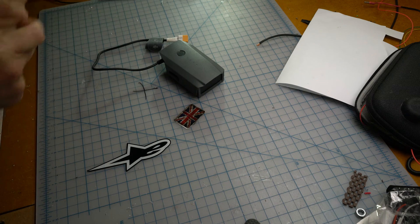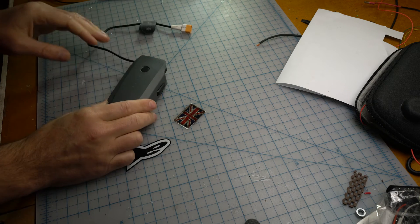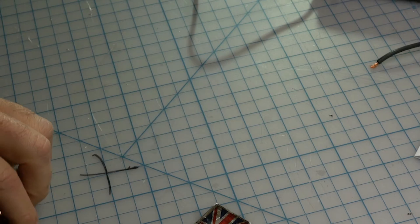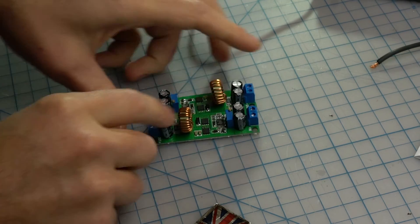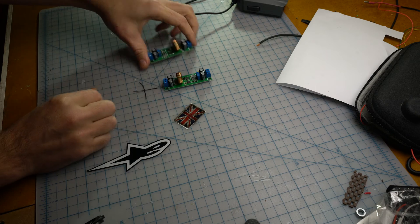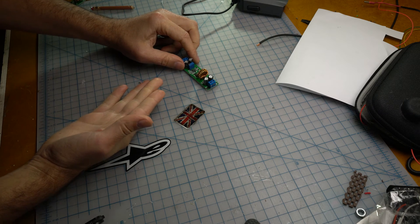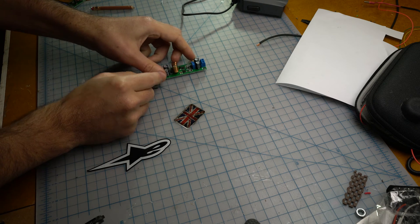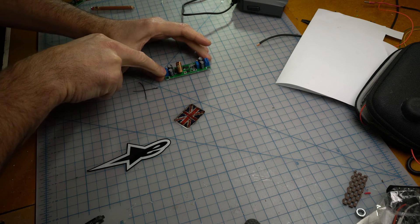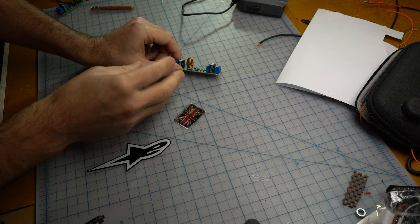Good morning. I'm going on a trip in a couple of days and I wanted a charger for the car. I'm a bit cheap to buy one so I'd rather mess around with electronics. These arrived - two of them - six bucks each. They're step-down converters. I always buy two because I'll probably break one. This will do 60 volts down to 1.25 volts, and the whole thing is meant to be eight amp restricted.